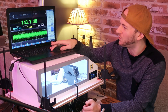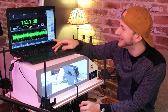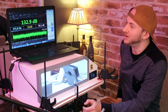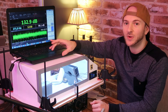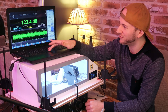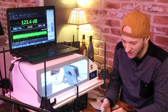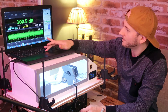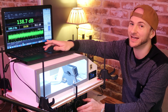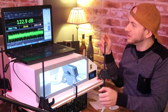That's almost exactly the same — a 141.7. Pretty flat so far. This is similar to what we've seen with a couple of other enclosures, but they tended to drop off on the higher frequencies. Let's see if it can maintain this at 45 scaled hertz being 270 Hz — 132.9, so that's quite a bit less, almost 10 dBs down. At 60 scaled hertz being 360 Hz — a 123.4 at 15 watts on the meter. I'm quite surprised; it seemed quite loud in person at those higher frequencies. Testing one more time with the door closed — 128.8, then 138.7 door closed. That 198 Hz frequency is so loaded. Back down to 128.3, and 122.9.